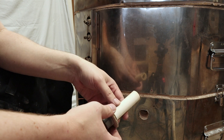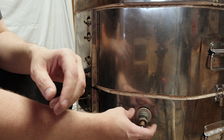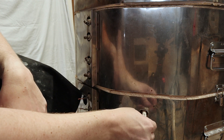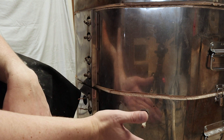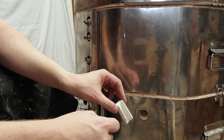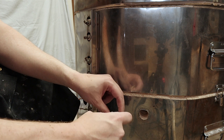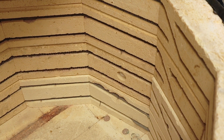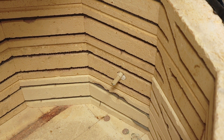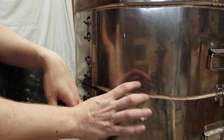There's one more physical modification I need to make. This is where the kiln sitter used to go — screwed on in the metal box on the outside. I want to replace this with a thermocouple, but the thermocouple is much smaller in diameter, and I worry that kiln heat will come through with a big air gap, which would be a problem for the electronics on the other side. So off camera, I took a piece of fire brick and cut it down so the outside diameter matches the old piece. I cut out a groove for the thermocouple using sandpaper. It fits in here, and now the thermocouple goes in just like that. I can put the thermocouple block on the outside and connect the wires — I might cement it in, I might not. But now I don't have to worry about that big air gap.